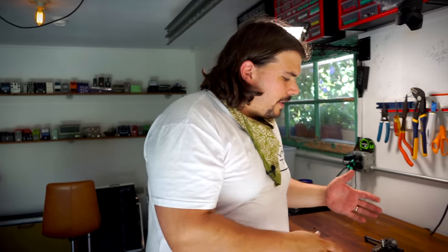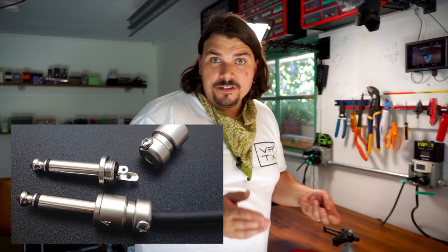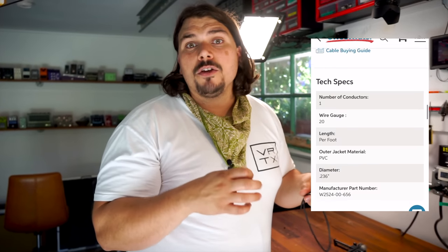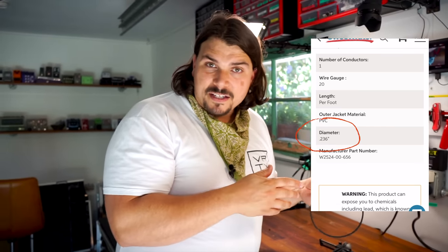Today I'm going to be working with my exemplars, the SP400 and SP4. These are the smaller diameter versions of the square plugs, made for a smaller diameter cable. I'm going to be using Mogami 2314, a smaller diameter patch cable. If you see something that says SP500 or SP5, that's just for a larger diameter cable like a Mogami 2319. If you look at the spec sheet of any cable you're considering, it will tell you the outer diameter, and you can compare that to see whether it matches an SP4/SP400 or an SP500/SP5 — just the larger diameter versions of the exact same plug.